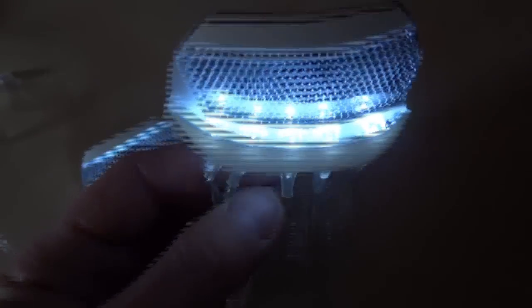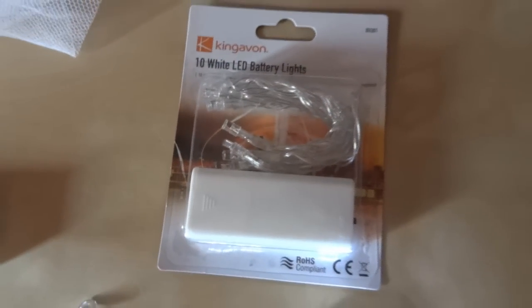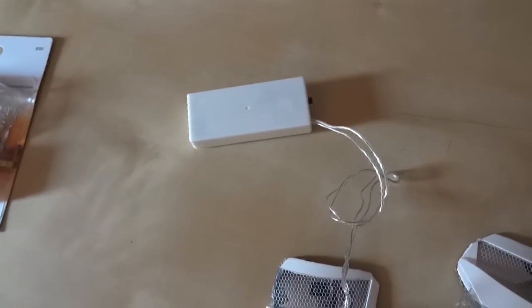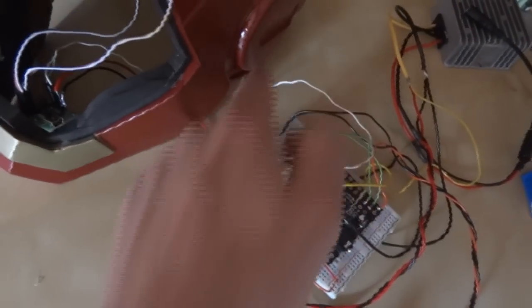The plastic surround is just thin strips of styrene plastic glued on. I've got some LEDs in the bottom there which shine across the scrim fabric to diffuse the light. I just used some cheap battery lights — I think they were £2.99 for a pair on eBay with free delivery — and those are just hot glued in there. At the moment I've got the battery box that came with them, which is just two AA batteries. But eventually I'm going to replace that with the power supply I've already got, and wire those to a spare channel configured as a digital out so I can turn them on and off. So I still only have to send data along one wire to the helmet to control the lights and everything.